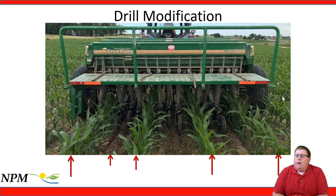How we modified our drill was by taking some row units off to allow three seed units to be placed within that 30-inch row of corn. This allowed us to interseed across three rows of corn during a 10-foot pass. We did have some areas that weren't interseeded and required a second pass to fill in, but it's all about matching equipment size to planter size to prevent crop injury.